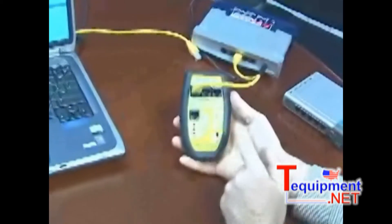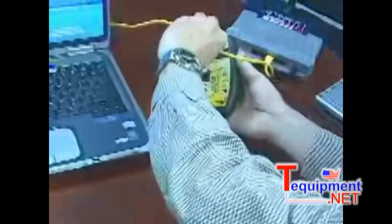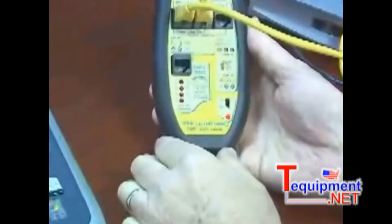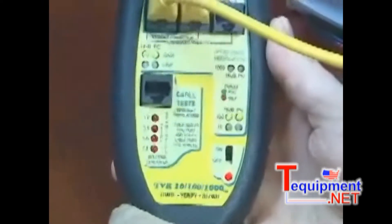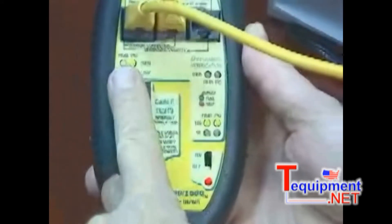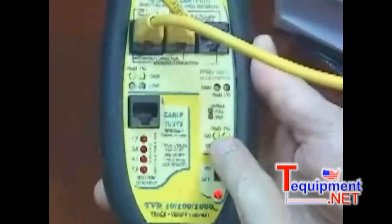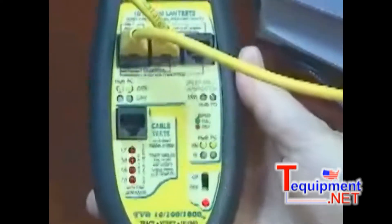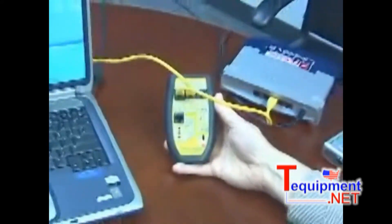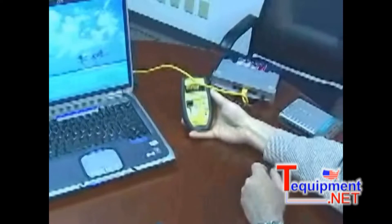Now watch this. I'm going to connect this gigabit LinkSys switch into my notebook, which we know is only capable of 100 megabit. I'm going to use the center socket for a straight-through connection — if I use the right socket, I'd be creating a crossover connection. And now the TBR1000 tells you what the final negotiated speed is in this link. It says that one of the devices is configured as a hub, the other is a PC, which is what you would expect, and they negotiated to a 100 megabit full duplex. This is extremely powerful, because you can test this device and you can test that device, but unless you can go inline, you really don't know what the devices ended up negotiating for speed and duplex. And the TBR1000 makes it very clear.